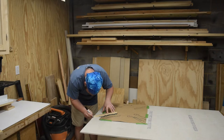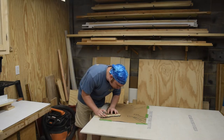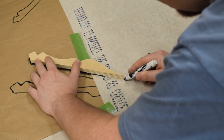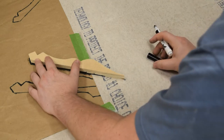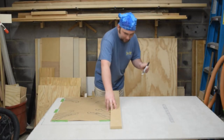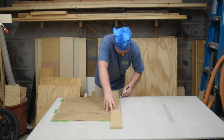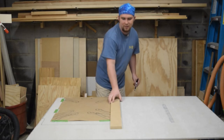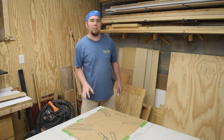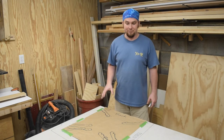Then mark a dot at the tip of the stick, repeating this process for each of the outlines. Once you've gone around all the outlines, just line up two tick marks and connect the dots. This is a pretty basic use of the ticking stick — you can do shapes that are a lot more intricate and a lot more complicated.